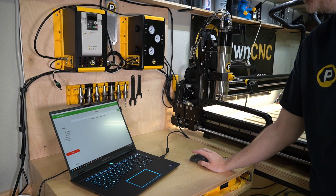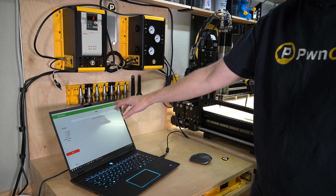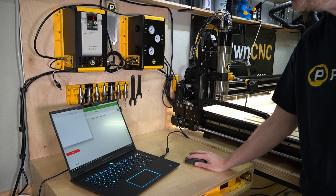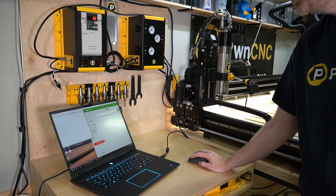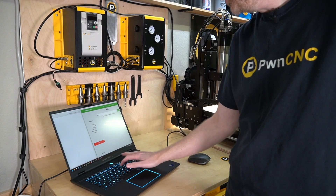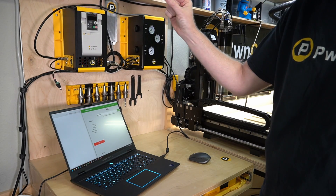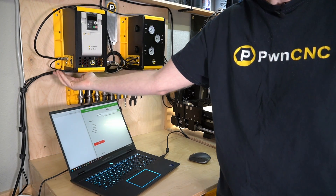To test that, we're going to hit and go to the MDI screen. If you don't have that enabled, click Settings and on the first tab for Options, check the box that says Enable MDI. That'll give you the MDI tab at the top. What I like to do is pull up the settings and show the log so I can see exactly what's being entered, because what you enter into the MDI is what will appear in the log as well as the results. I'm going to rearrange things so I can see the log on the left and the MDI screen on the right.